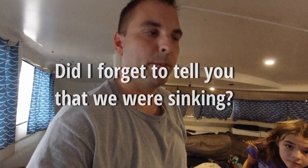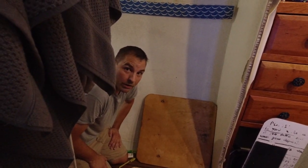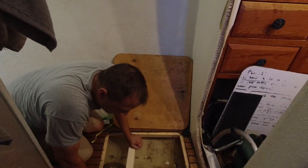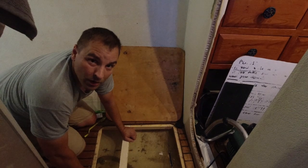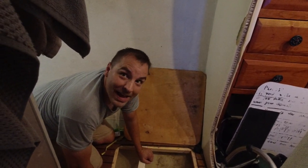After our slow sinking a couple of days ago, we need a bilge alarm. I'm going to go down there and show everybody what's happening. We're sinking - well, we think we're sinking from a faulty shower drain. We're not really sure, and we've learned that we don't have bilge alarms, but I've got at least 10 inches of water here. I opened up Ella's floor and we've got 10 inches of water in there. After we get this pumped out, we can try to see if the shower drain is the problem. Becky thinks the shower hose may have come disconnected, because we're a catamaran and the water has to be pumped out. She didn't mention it until just now when we found all this water - it just sounded different. When you hear a difference in sound, you say something.